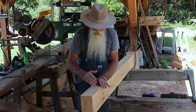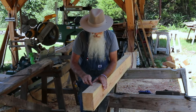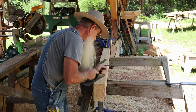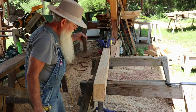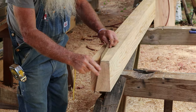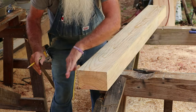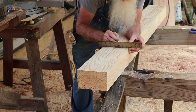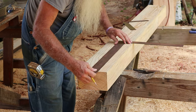The reason I want to check especially the bottom is when I lay out that scarf, I want the part back here where it starts to sweep to look square across. If I'm a little bit cockeyed there, my line could go at an angle and I don't want that — I want it to be straight across. So I'll probably have to do a little work here so that when I connect all these lines it'll look nice, clean, and square. I'm shaving ever so slightly. I've got a mark here that's seven and a half inches from the end of the beam and I've squared my line across there as a reference. I'm going to come down from the top four and a half inches and make a mark, then come back and mark it again at four and a half.